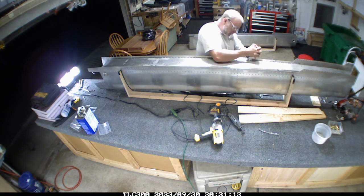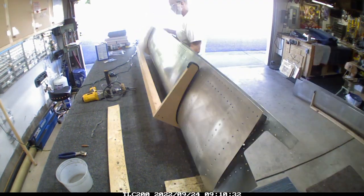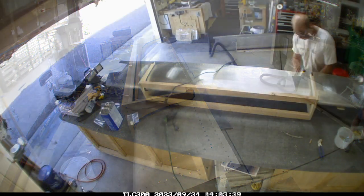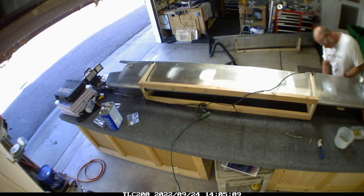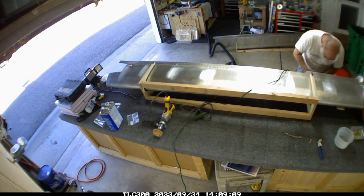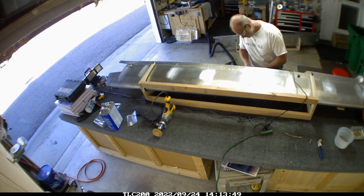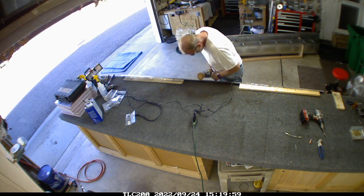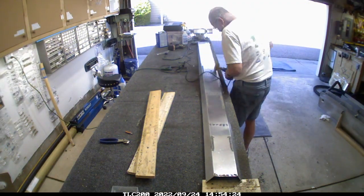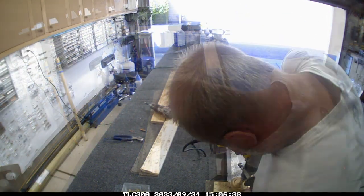On to the second tank — now that I had a plan in place, this one actually wound up being a little more challenging to separate the back from. I picked up a couple tricks: I had a thin aluminum bar that I basically used to pull up enough of the back skin to put a new rivet in, which gave me some grabbing points to pull a little on the skin. Just enough to get the pro seal to stop adhering, and it slowly separates — because once it gets going it just kind of gives up and releases. That went just fine.